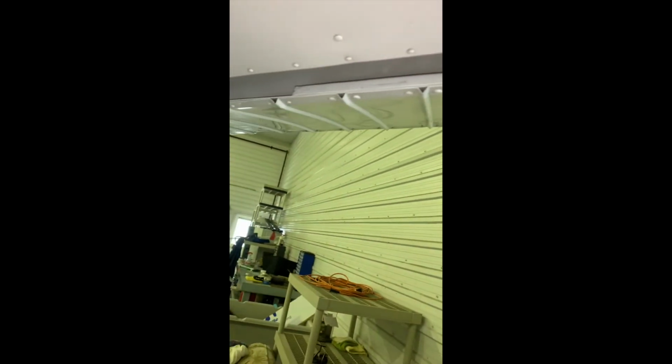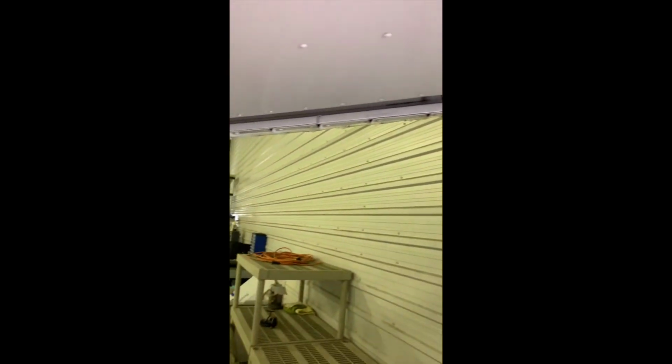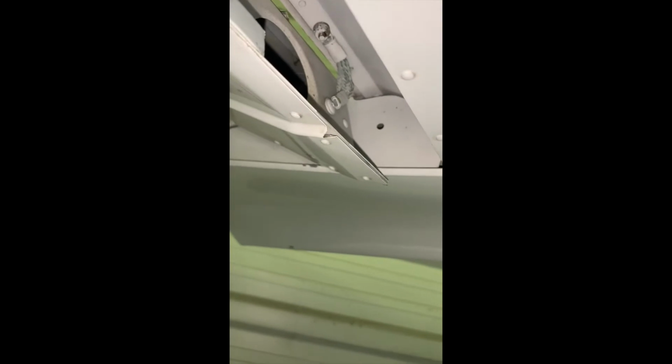Now on the outside of the ailerons, we have these 3 weights, and they're there to help reduce aileron flutter. So you want to make sure that those weights are in fact there. And then we just have a connection for your static electricity to travel to the static wicks. Be very careful during your walk around that you don't break the static wicks, because it's something that happens fairly common and it should be avoided.